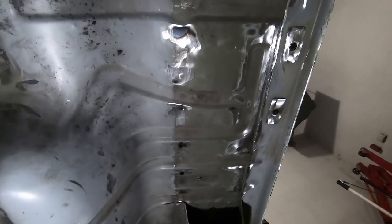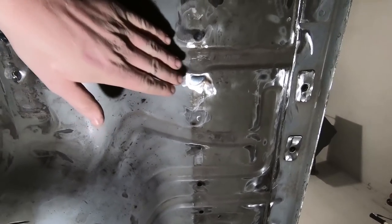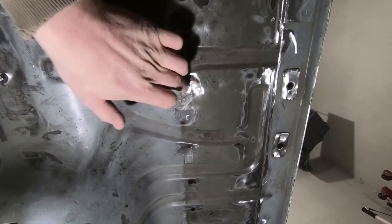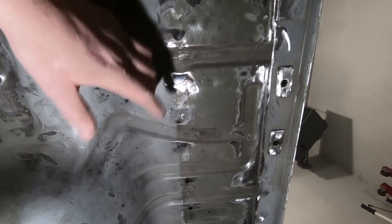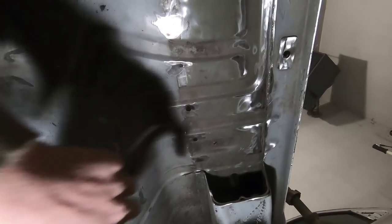So we fared much better with the spot welds this evening. Those cutters worked. The only problem is, I drilled a little pilot to try and keep it centered, but you really have to let it get its groove before you apply any pressure, otherwise it runs off. But we got them, other than a couple where we went all the way through.